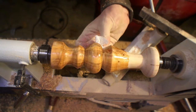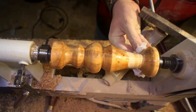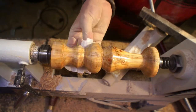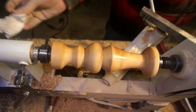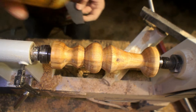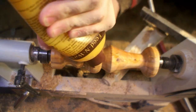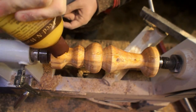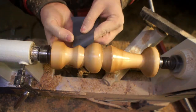I went up all the way through the grits — I started with 80 and went all the way up through 220 before I started putting the super glue finish on. Super glue finish is cool; it's going to allow me to basically polish this up to pretty close to a mirror shine. It just gives you a hard surface to work with. I know super glue is supposed to dry really fast, but I've found that if I let it sit overnight, the paper gets gunked up a lot less. I just seem to have better luck with it.